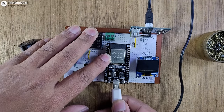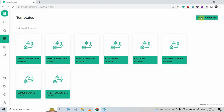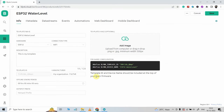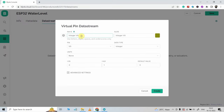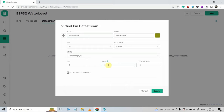Now we will connect the ESP32 with the laptop for programming. Before programming, first we have to configure the Blynk Cloud. Here we will create a template — I will click on new template and give a name. Hardware will be ESP32 and connection type will be Wi-Fi. Now I will click on done. Then we will go to data stream and click on new data stream, select virtual pin. For the first data stream, I will give the name water level — it will show the water level in percentage. I will select V1, unit will be percentage, minimum value zero, maximum value 100, and data type will be integer. Now I will click on create.